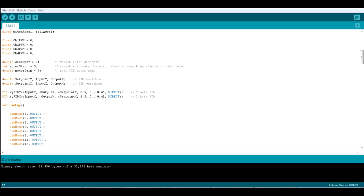This will probably only mean anything to you if you looked at the code review I did at the end of the last episode. Basically, I'm using two PID loops to drive the axes, which have various settings for proportional, integral, and derivative amplifiers. The loop is running at 10 milliseconds — so every 10 milliseconds, which is 100 times a second, it checks the sensors and tries to correct its balance.